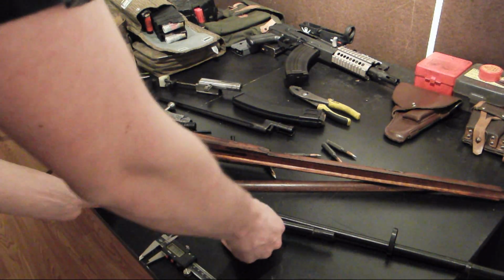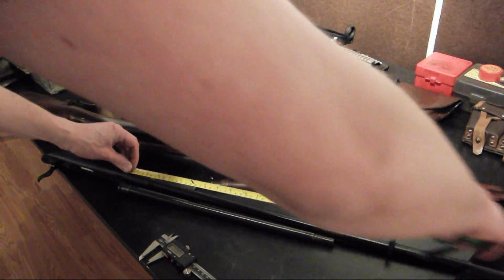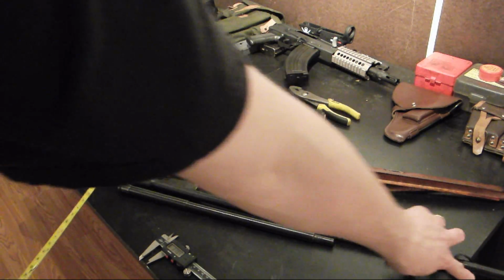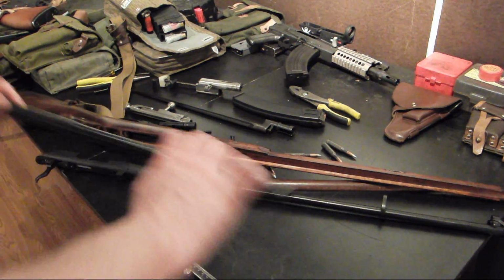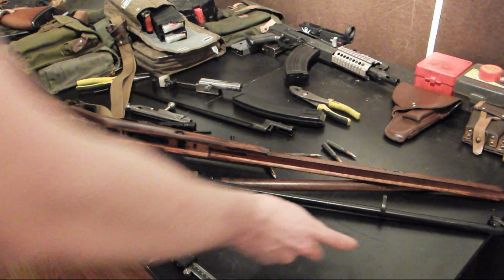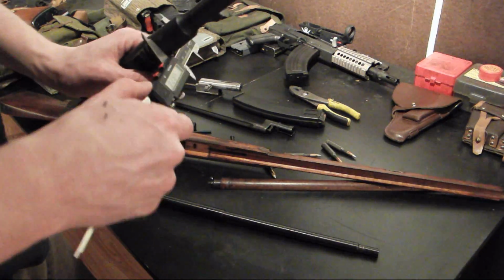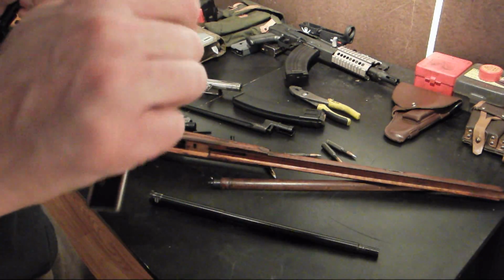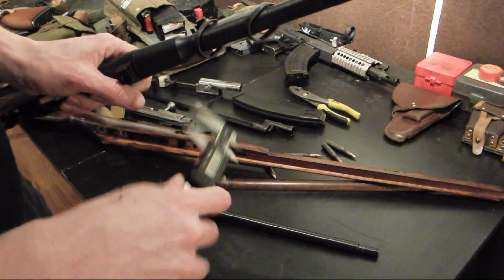Now, obviously, if you look at it, if this barrel was only 10 inches long, there's enough Mosin barrel lengthwise to make it. From the receiver ring forward, we've got about 28 inches. So, roughly the barrel ends approximately here, extends out to here, and that gives us plenty of length to deal with. Now, the problem is this profile. Now, if I start at the receiver end, the ring end right here, right? Measure the receiver ring. Remember, we had 1 inch there. Oh, let me re-zero this thing. Sorry. Okay, so zeroed. Measure the receiver ring end.